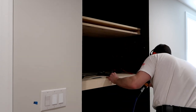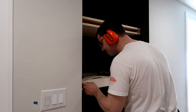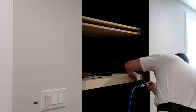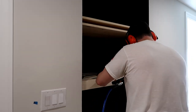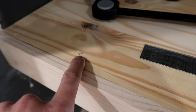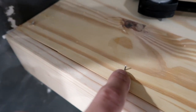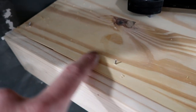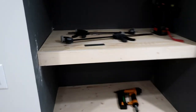The very last bit is actually getting the face plates attached. I'm using a brad nailer, just holding those pieces and putting the face plates in, then actually putting the brad nails in so that the floating shelves will be completed. One nail blew through — that means I need to clip those off and sand it down. That makes me angry, but otherwise it looks pretty good.